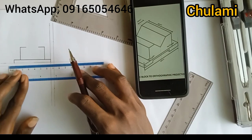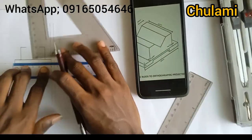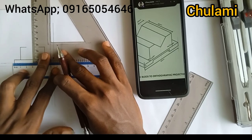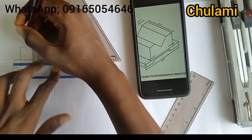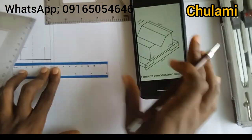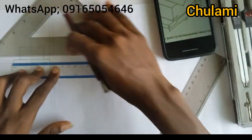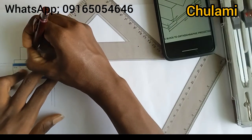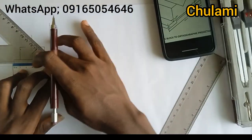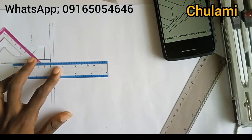Have a look at it — there is a center line there. So I'm dividing the total 60mm length into 2, giving 30mm. At that 30mm point I will draw a center line. Now at that point I'm using a 45-degree set square to create the projection line. The isometric drawing uses 60 and 30 degrees, but while doing this in 2D full scale, I'm using 45 degrees.